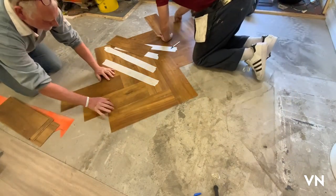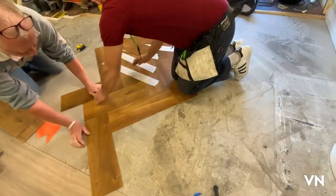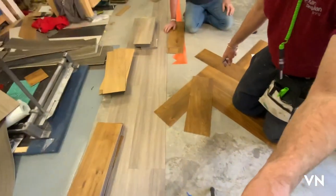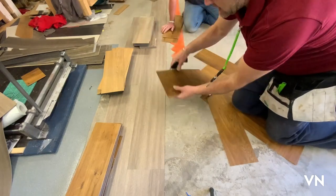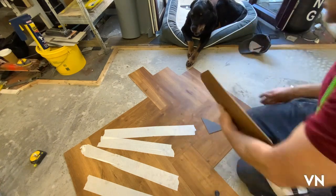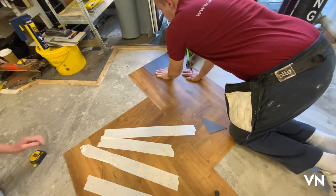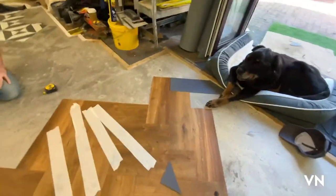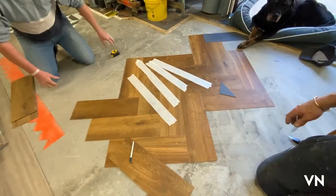This is going to be the real test — just to test our theory. So in theory that's going to be our cut. I don't know if you can see it guys. It's not a brilliant cut, but I just want to quickly check if it is going to be an equal cut to both sides. Although not millimetre-perfect there, you're looking at that as being — it doesn't even matter if you're not dead on perfect. That is a simpler way to set out any herringbone. You just divide it by two and butt them all off a straight line.